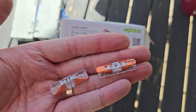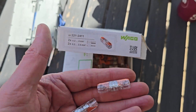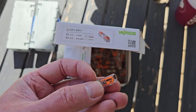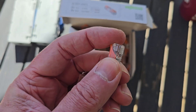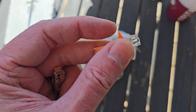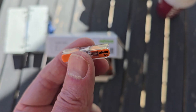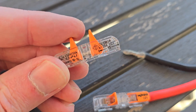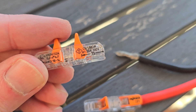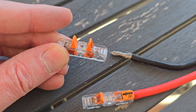To attach the wires I'm going to use these Wago connectors. I've not tried this in this particular setup before so it's a first-time test, but they should work — these can handle about 30 to 40 amps. They're super easy to use: pull up the levers either side, put a wire in each end, and snap it shut. There's a little diagram on the side showing how much wire to strip — about 11mm. These things are so useful, I use them for everything.